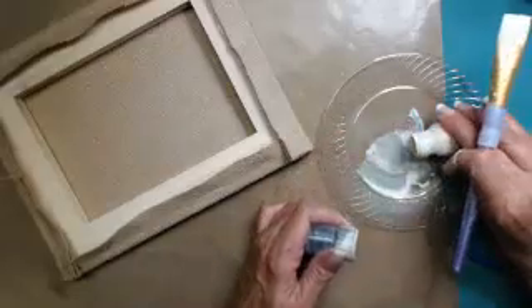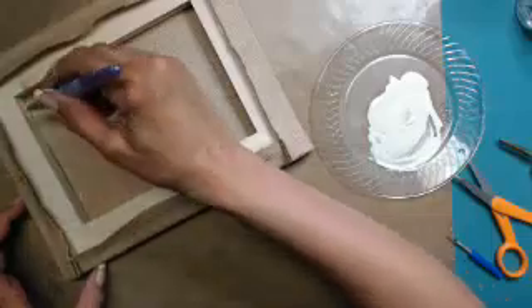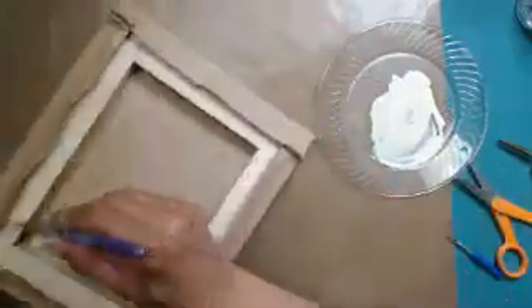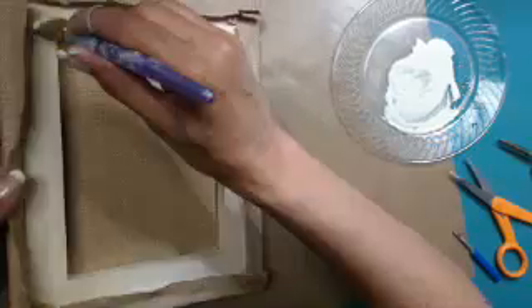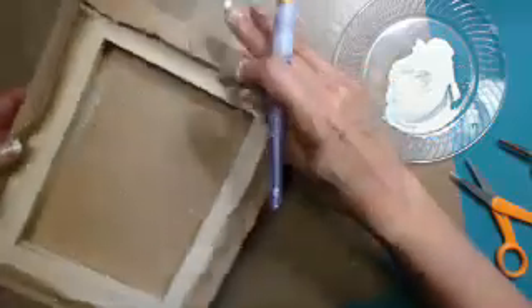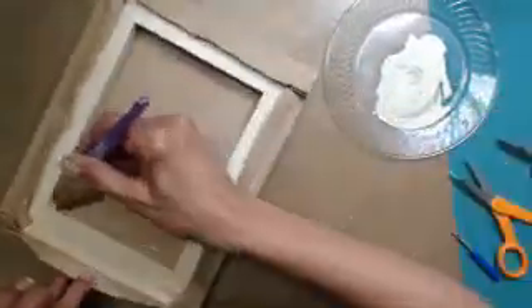Make sure you get up on the sides and cover all the wood pieces. The paint I'm using is pretty thin, so I'm not adding much water, but just enough to make sure it's not doing full coverage — because my idea is not to get rid of the look of the wood. If you get to where you've got too much and feel like the coverage is too heavy, you can always give it a quick mist. It'll make the paint move a little better and bring some of the wood back where it'll show.